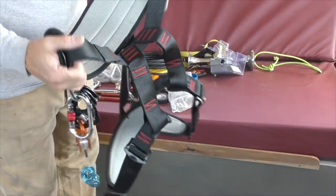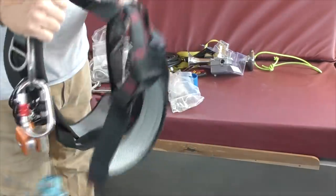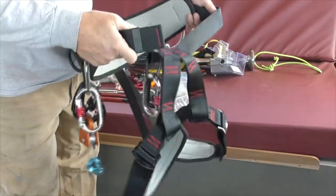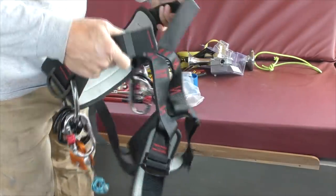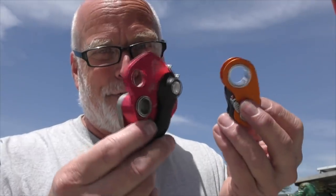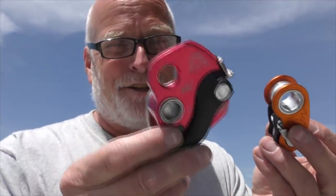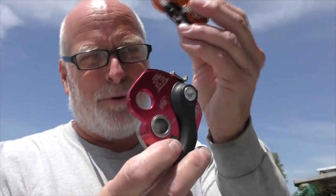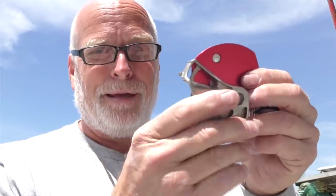I don't use a bosun's seat — I just use a regular climbing seat because I'm more familiar with them. The bosun's seats nowadays pretty much are a climbing seat with a bench. This is a grigri and a cinch combined, and this is a rolling lock. I put this down below and this up above. It's nice if you have the line loose going down from you, but sometimes you can't do that — you'll have to have it tied in because the boat's swaying too much, and you don't want to pendulum with the top of the mast.